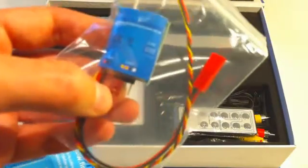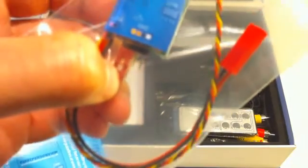At the bottom here you've got OSD pins, 4 pins, which plug into your OSD. If you're not using an OSD, this jumper pin stays connected over the furthest left two, and you'll see we say this here. This is the jumper. You must cover these two.